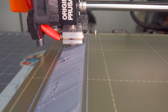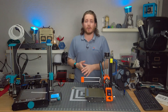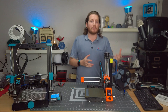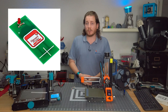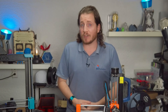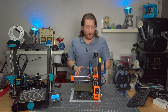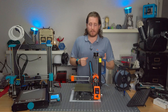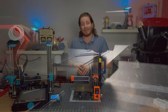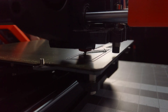What you can do is loosen the limit switch and move it down some — that's a totally reasonable thing to do. A very slight amount of movement is way more than you think, so be careful. If you do lower your Z limit switch, make sure to tighten your bed springs by quite a few turns. I'd much rather have you go back and re-level your bed with something like the Filament Friday bed leveling tool or the paper method than have your nozzle crash into your bed, destroying your nozzle, your bed, your printer, or combinations of all three. If it's still not sticking and it looks correct, your bed might still be dirty — you need to clean your build plate. Grab some alcohol, put it on a paper towel, and clean that build plate off.